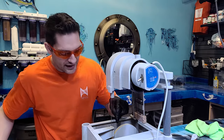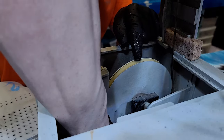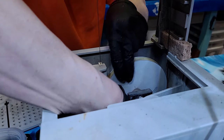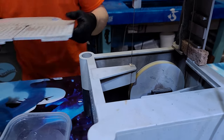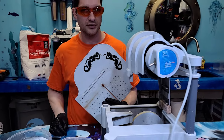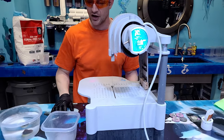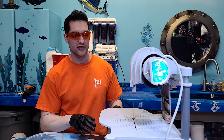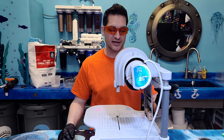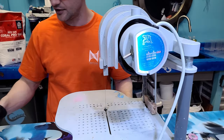The blade in the water — you should not have water above the bottom of the blade and the sponge, because what happens is you get a spraying effect and you'll actually get wet. The saw is ready to cut now. We have water in place, we have our sponges, we've checked the tension on the blade — the blade is correct. There's an adjustment screw on the side if it's not. We adjusted it, tested it out, it's all ready to go.